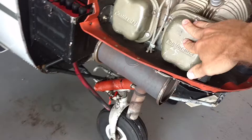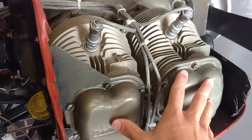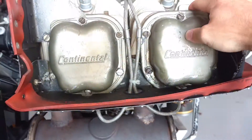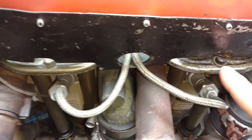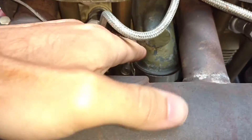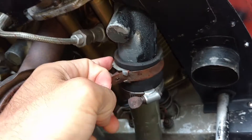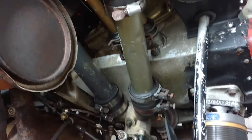Next, we've got our valve covers on the top of our cylinders. There's a seal right behind here, and that seal keeps the oil trapped in there that's lubricating our valves. Coming down below here, we have the bottom part of the valve covers. You can see a little bit of oil dripping there past the seal, and you can see the intake pipes running from the carburetor up into the cylinders with those little rubber gaskets that join the actual intake pipe to the cylinder.